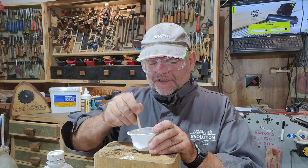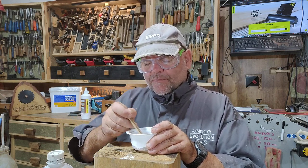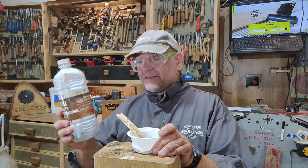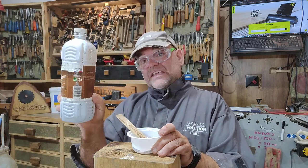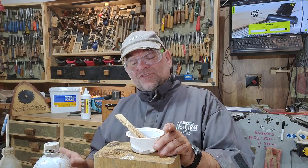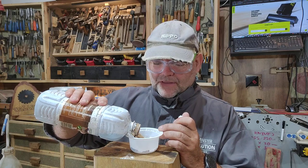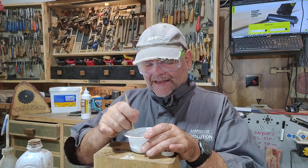It's pretty obvious what I'm doing now — it's going to end up a brown colour. Now you have a choice: you're going to either add more of this so it ends up being the colour of the dye, or let's say your timber is a little bit lighter than oak. If you use it in its neat form — but you could actually water it down a little bit with water at this stage, like you would mix it normally. I'm going to make it a little darker just so you can see what I mean. I'll put a little bit more wood dye in there and give it another bit of a mix. I do it bit by bit — I don't put too much water, or in this case the wood dye, in at once, because what happens it'll separate. So I'll do it until I get a bit of a paste.